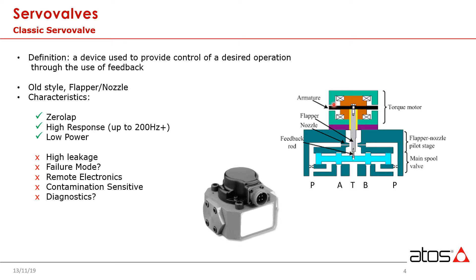For example, theoretically, if we applied a 50% command signal, we should move this to one position, this pressure will increase, and the main stage spool will start to move. Theoretically, the net force balance at some point should be around 50% flow for this rated valve, give or take probably up to four or five percent based on hysteresis, which is another parameter we'll talk about shortly.